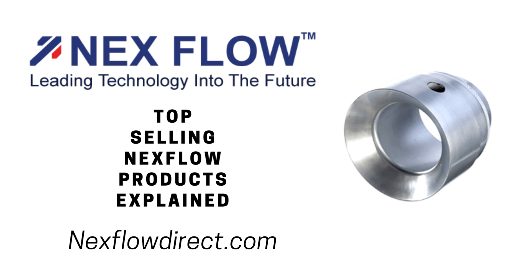Because the compressed air entrains the atmospheric air to produce that high-velocity outlet flow, behind the entrance of the amplifier from the back, you're entraining the atmospheric air — actually a very high volume — which allows you to utilize the product for venting applications.